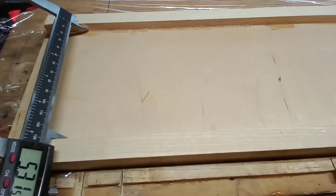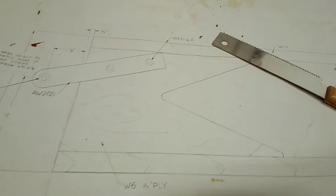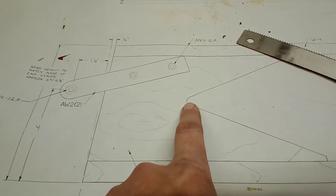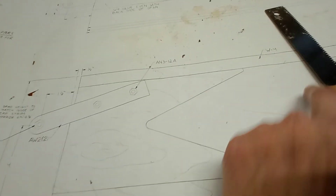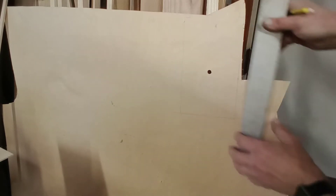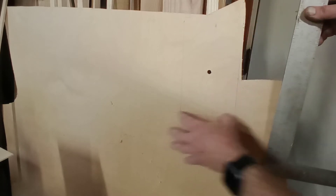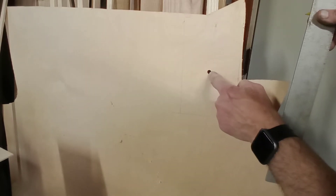Here's the next step: five inches, three hundred and fifteen thousandths. I'm going to build up the root section here. I'm going to drill a hole through it, then scribe a line down and cut that angle with my oscillating saw. I'll lay it out while it's right against the wall or against the other lumber, just make my rectangle, then measure up in the center to drill my radius.